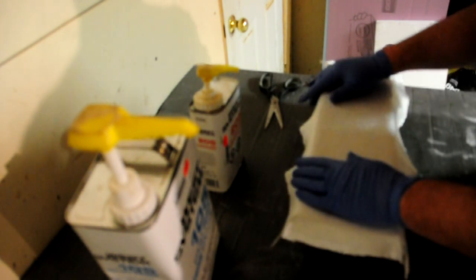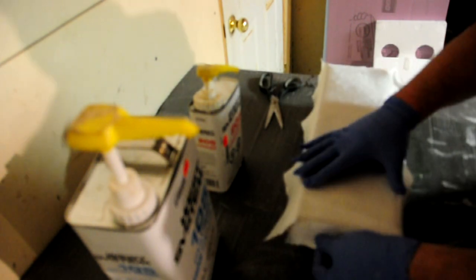Anyways, this is for the underside of the mast step on top of the compression post, so just a little bit of a surface to spread the load out and connect back to the sort of cockpit combing around the companionway. Just laminated up a little more than an inch thick, and I'm just going to coat it with some fairly light glass and epoxy, just for appearance, but mostly to seal it up so that it's nice and sealed and won't take in any water.